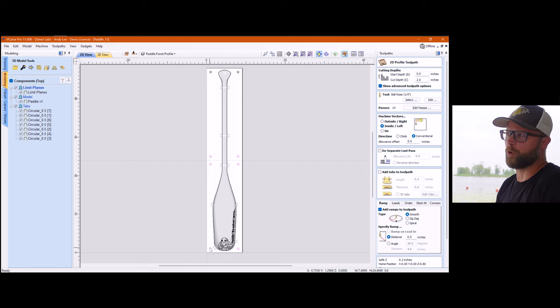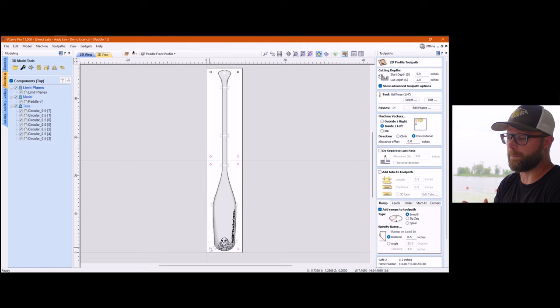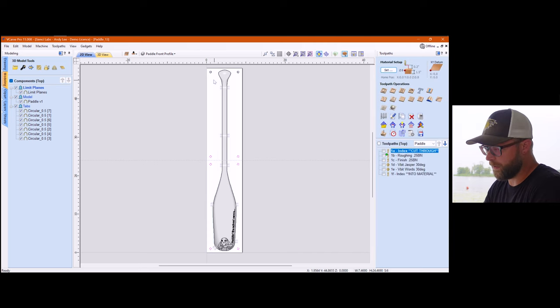And when you're just normally doing slides without index, without flips, it's pretty basic. You can just, you know, leave a mark that you're offset. If it's 20 inches, you mark 20 inches and you slide by 20 inches. It's much more straightforward than this. But because I'm doing tiling and flipping, I wanted to make sure that when I tiled, I also was keeping everything lined up. So I actually ignored the tiling pass for this, and I drilled the six holes here first so that when I slide, and it's going to be hard to tell on my screen, we may have to do something, we have to do an animation or something fun.